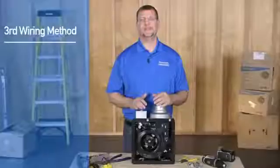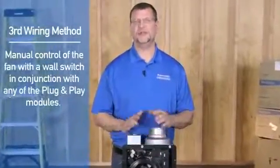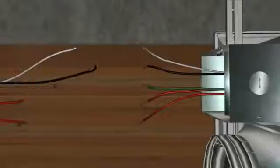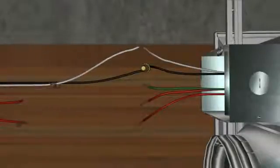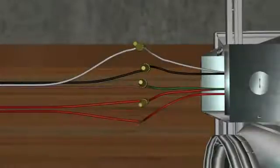The third wiring method we'll discuss is for manual control of the fan with a wall switch in conjunction with any of the plug-and-play modules. For this wiring method, simply bring the power supply from the source directly to the fan's junction box. Bring the power lead — the black conductor — to the black lead for the fan's motor, the neutral white wire to the white lead in the fan's junction box, and the bare ground wire to the green conductor in the fan's junction box. The red wires in the fan's junction box are signal wires designed to turn the fan from standby to on, or from low to high speed if using the continuous run module.